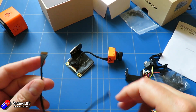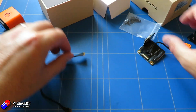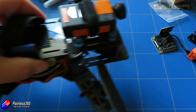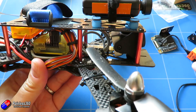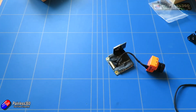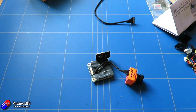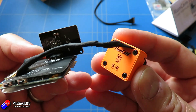To change the ribbon cable out, you'll probably end up having to take the screws out of the back of the HD camera itself. But it does mean that if you have a particularly long quad, or the space between where the camera is mounted and the flight controller stack is a bit longer than can be supported by the supplied cable, you've got that extra choice too. In terms of connecting it into your model, it's pretty straightforward. The power and everything for the whole system comes from one connector at the back — a standard three-pin connector with ground, plus five volts, and the video signal as well. Be very careful about making sure you're plugging it in the right way.